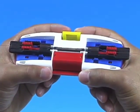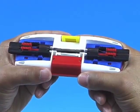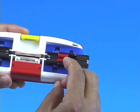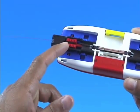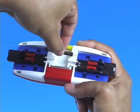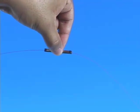Press the yellow lever to disengage the wedge from the Splice Connect Mechanical Splice. Slide the fiber holder clamps to release the fibers. Remove the Splice Connect Mechanical Splice from the Splice Connect Mechanical Splicing Tool. Splicing is now complete.